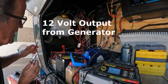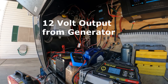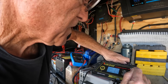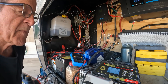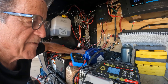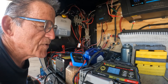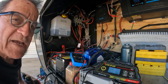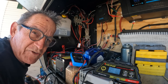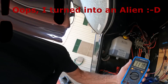I'm going to put the leads again on any positive and negative, and now the charger has started to connect. This charger doesn't have a setting for lithium batteries, which these are. If these were lead-acid, I would have killed them — you do not ever want to drop a lead-acid battery to zero. With lithium batteries, you don't ever want to charge them with more than 14.7 volts, as that will damage them. So as long as you're monitoring the volts, you're okay.